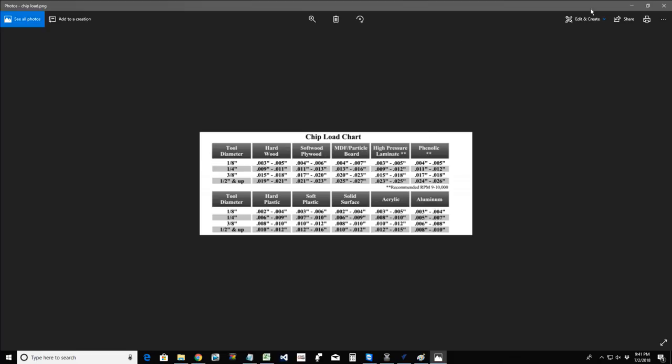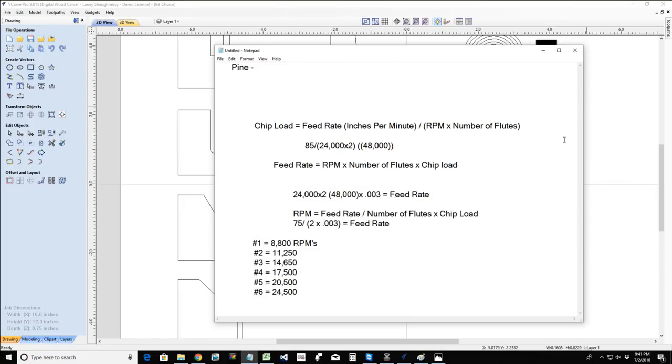All right. Now, William says, can you go from the Planet CNC TNG 1030 to the 626? Absolutely. Here's what you've got to keep in mind, William. You're going to need the new post-processors. They are in the Facebook owners group. They did the Vectric post-processors: DWC inch tap, DWC millimeter tap, and DWC laser tap. You will need to import those into your Vectric software when you switch over to the 626 of the TNG,